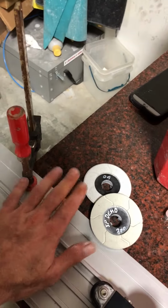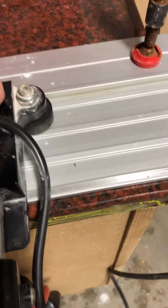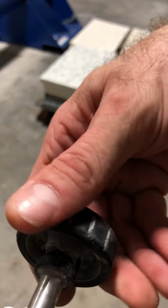Now there is a little rubber padding on the base of the glide guide. Let's see if you can see it. That'll help a little bit, but at the end of the day, it is still just a rubber patch. Now, when we're actually running the seam phantom, you'll see these little wheels. We need those wheels to be moving regardless of what step we're on. If that's not moving, that means that our depth is too far in and we need to release it a little.